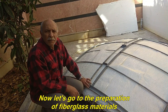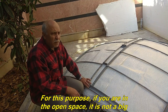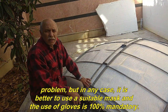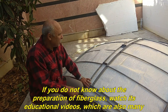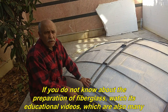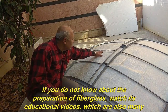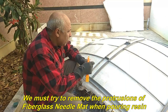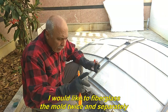Now let's go to the preparation of fiberglass materials. For this purpose, if you are in the open space, it is not a big problem, but in any case, it is better to use a suitable mask, and the use of gloves is 100% mandatory. If you do not know about the preparation of fiberglass, watch its educational videos, which are also many. We must try to remove the protrusions of fiberglass needle mat when pouring resin. I would like to fiberglass the mold twice and separately.